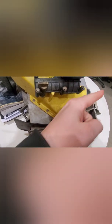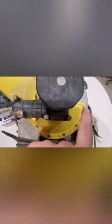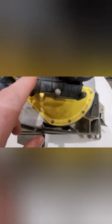The later meters have a solenoid here, which you're seeing in this next picture. If we had had that factory solenoid, it would have had a wiring harness that comes off and tees together with the wiring harness that attaches to the seed tube. That's the integrated wiring harness that John Deere had for the integrated shutoffs — meaning Row Command — and that was discussed in the earlier videos linked below.